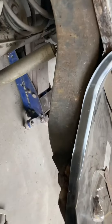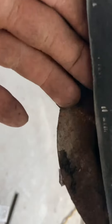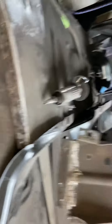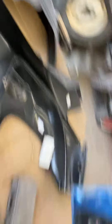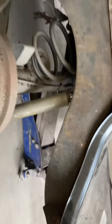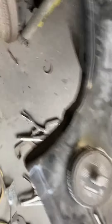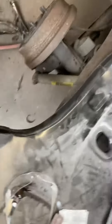Like I always mention about aftermarket parts — I got this side of the trunk pan in, and you can see where the old mount is there's a gap. I can put my hand in it; it's about an inch and three quarters away from the support where this has to go on to. The inner tub won't fit in there right now because this has to be cut and bent back in, so that's going to take a little bit. Aftermarket parts never just drop in 100% — you've got to make them fit.